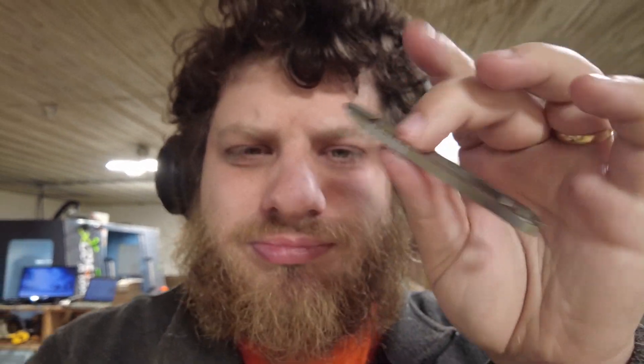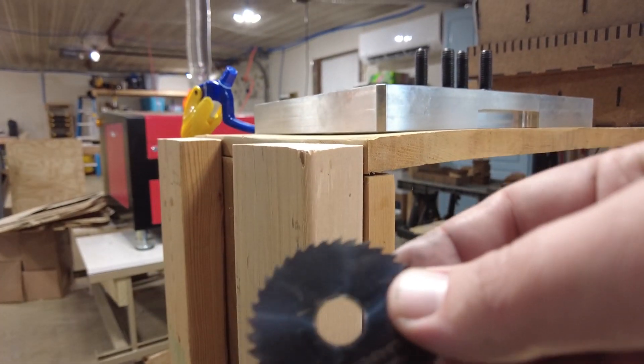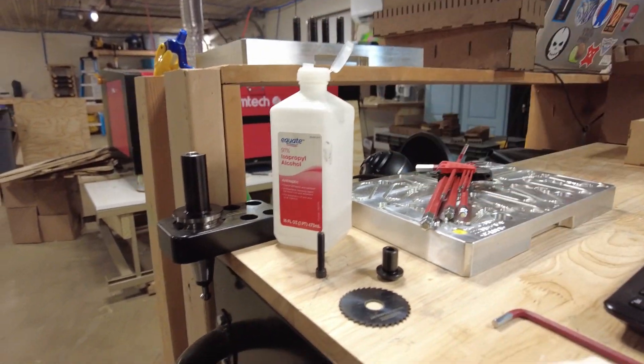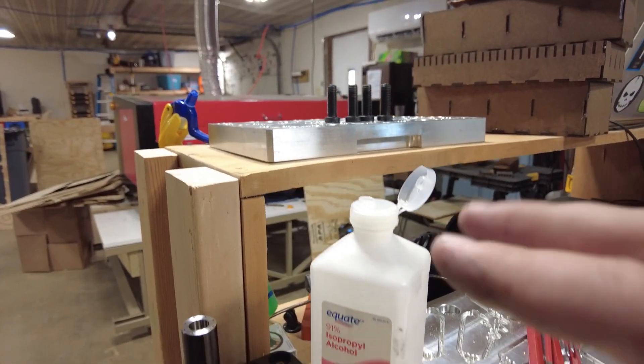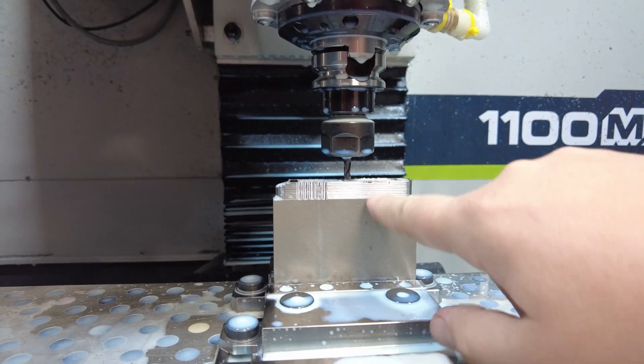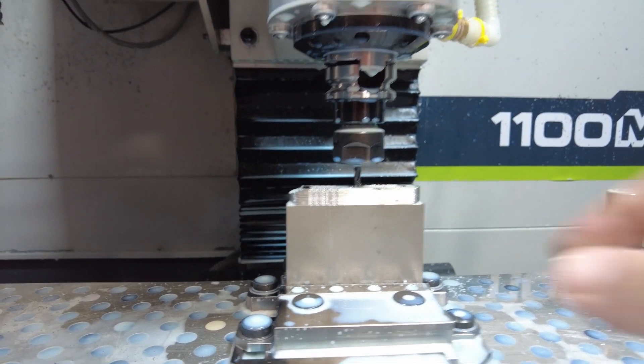The only exception is inside the jimping on the side — there's a little bit of chatter. I'm not sure if that's going to come out in tumbling because it's kind of protected by the rest of the pry bar. I was afraid this saw had a little wobble when it was cutting, so I've taken it all apart, I'm going to take some isopropyl alcohol, get everything cleaned down really well, and get it reassembled to make sure there wasn't a chip or something making it wonky. So we have a problem: I started a second test doing two pry bars in a row, but I did not check the correct checkbox in how it did the pattern, so it was doing all of its toolpaths in order instead of one at a time.